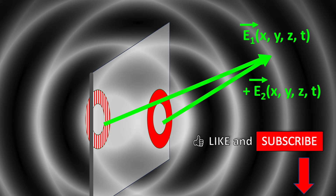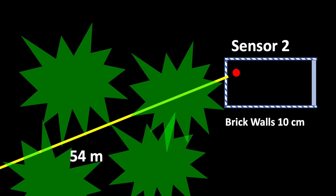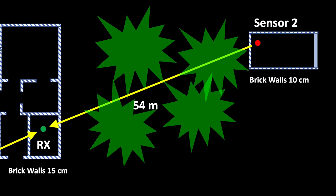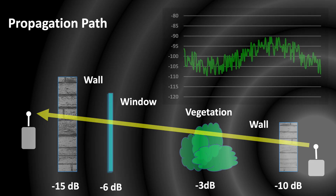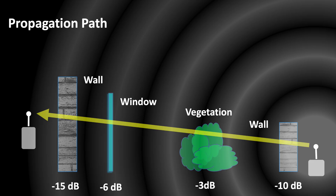Now, we are simply showing the effects using measurements. This is my own test range with 866 MHz LoRa links — a real-life scenario in which I have measured and compared several antennas before. A statistical analysis is important for evaluation, as the received signals are volatile. This is actually the standard method used by professional radio engineers.